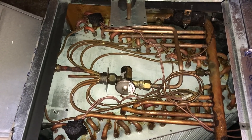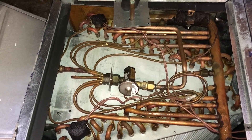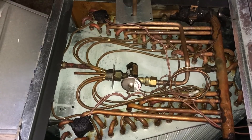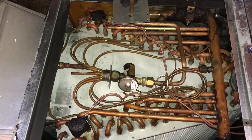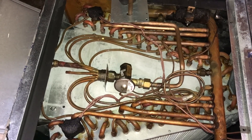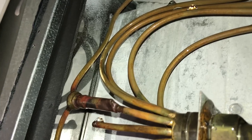When I was outside, my pressures looked good — I didn't see really low pressures. But my subcool was out of whack. I just want to see what's going to happen here because I may have flow through this coil, but do I get the correct flow?